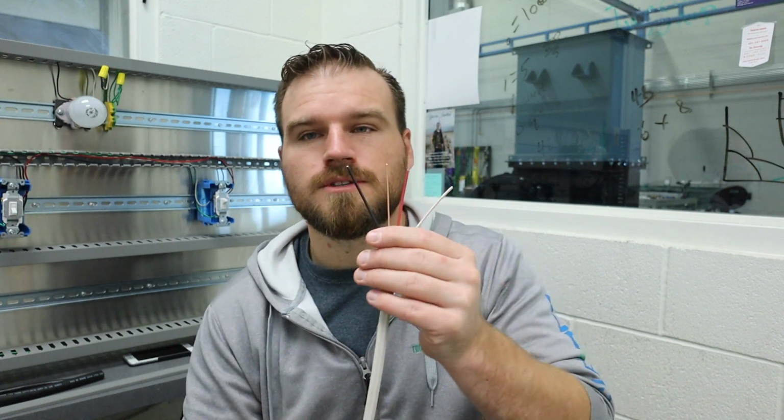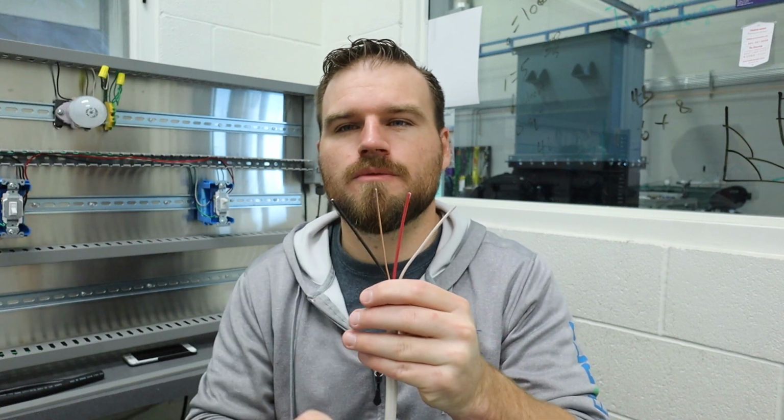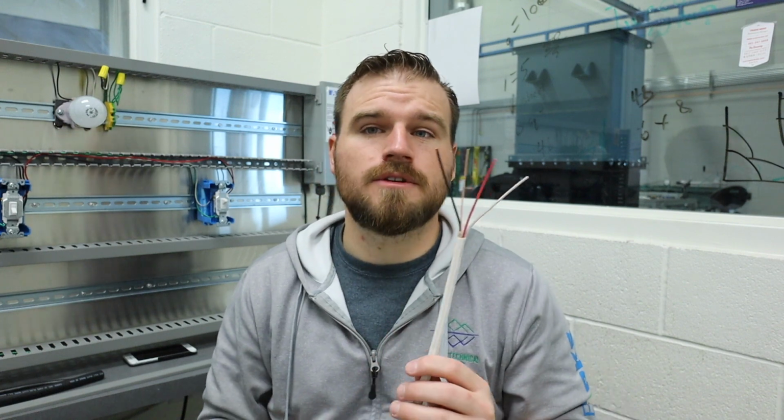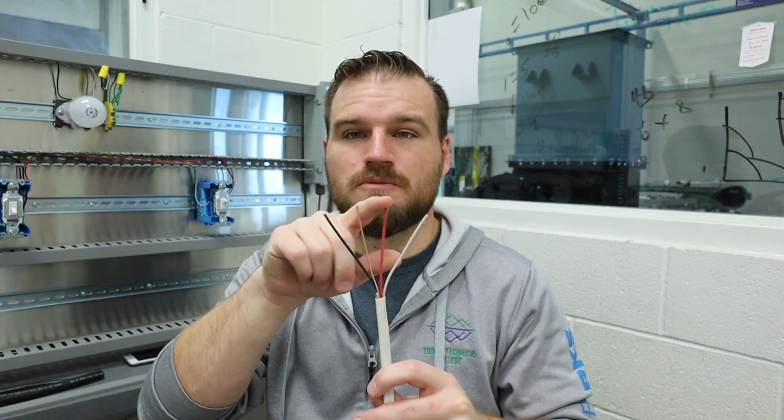Also know that most of the time when we're wiring our stuff together, we never use this red wire. The red wire would be used if we needed to, per se, have a light switch or two light switches that maybe control a ceiling fan. Maybe they'll use the red wire to turn the light on or turn the ceiling fan on, and then the green and red, or the white and the black would turn on the light or something like that. You see how there'd be multiple things happening, so that's why they would use that red every once in a while. It's also good for making a traveler to go in between switches, which we're going to do an activity later in the module where they actually go through and they need to use this red wire, okay?